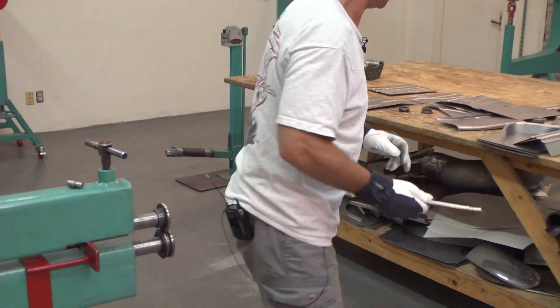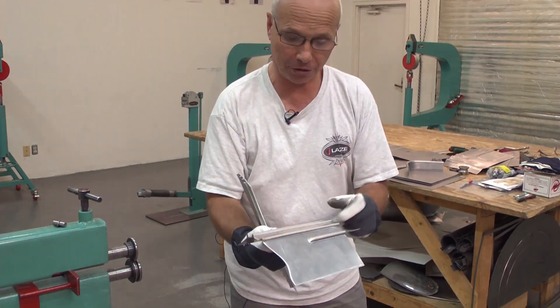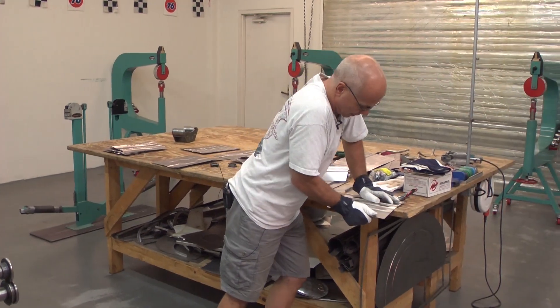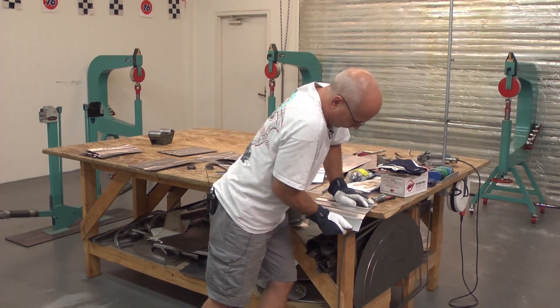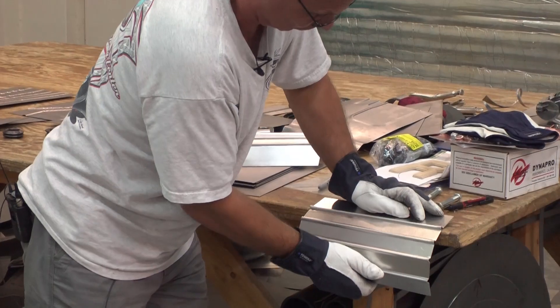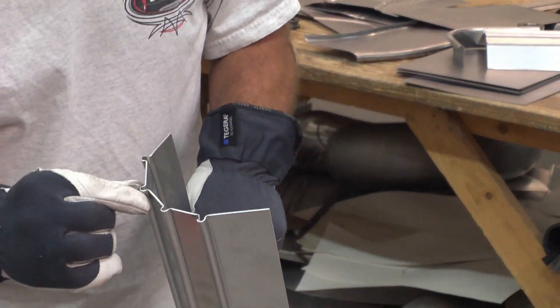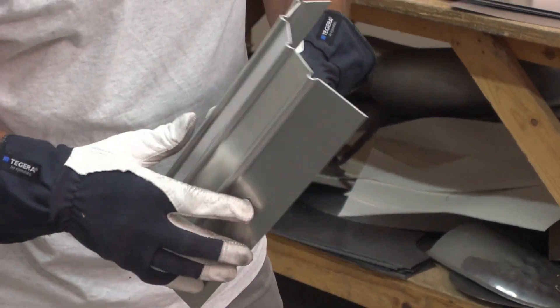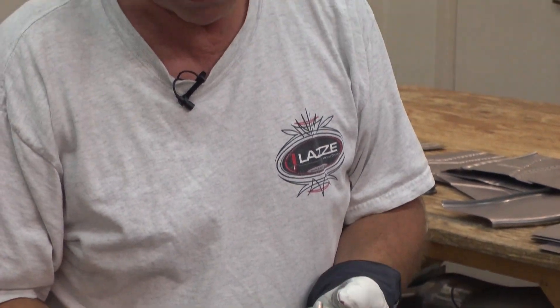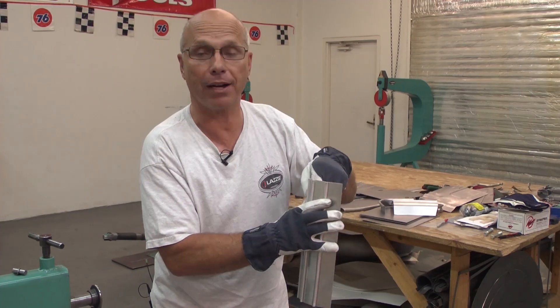But here's the trick. I had one made before and I bent that. So it could be something you do around a circle or around an oil filter in a car. I took this one and then I bent it like this. Now we have another interesting profile because it bends so easily because of that. It cracked a little there and a little there, but if you take it more carefully with more steps down, it will not crack. You can actually make a cylinder, and you can have more of those too if you want — around an oil filter on a car, an air cleaner, or whatever you'd like to use it for.